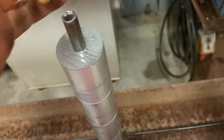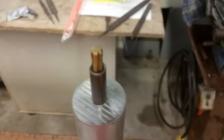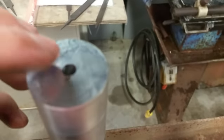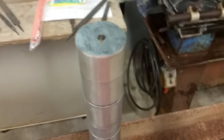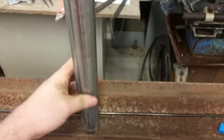Depending on how you spec your tube, the button will usually sit like that before you start pressing it in. There's a blind hole on this end, and you can just drop your button right in there. There's actually a little bit of a gap — some empty space — so you can basically prime your pushrod and place it in there, so everything's contained where the pushrod makes contact with the button. Nothing will get pushed off course once you go to run this. Let's go ahead and get that galvanized pipe over it.